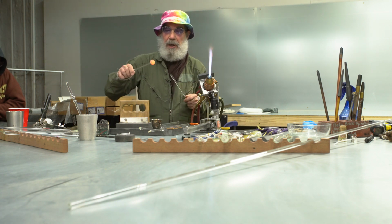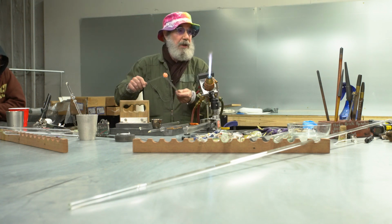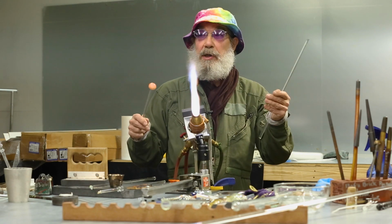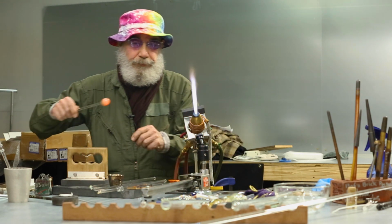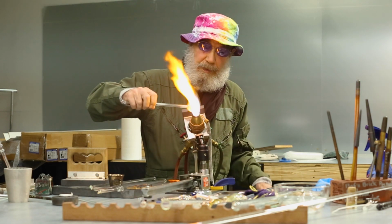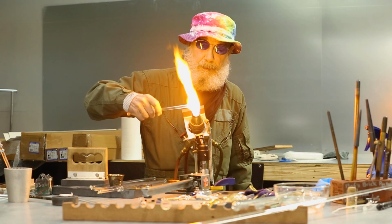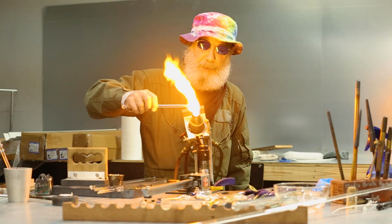Hot air is always coming up, so if I don't keep a piece going around and round, then it's going to get a chill spot. And if I'm blowing on a piece, if it's got a chill spot, that's the part that freezes. Sometimes you want to freeze that thinner area. And if you keep turning what you want to stretch to the upper side, that's how it's going to move. It's going to stretch on the upper side.